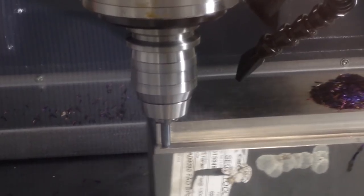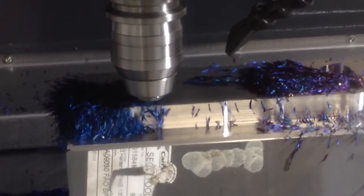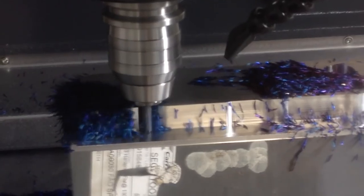What's good about it? It's got a tapered core, it's really strong. It's got a lot of clearance on the bottom for helical interpolation to get yourself into cuts so you don't have to drill any holes. We can get up to 30% width of cut on the tool. It's got 2.5xD reach capability, which can be fully utilised.